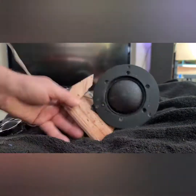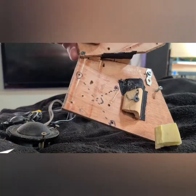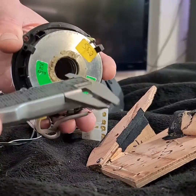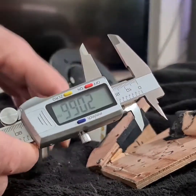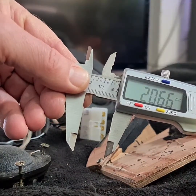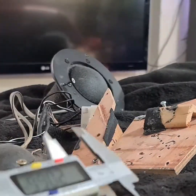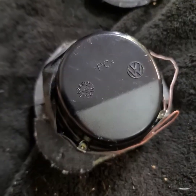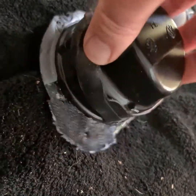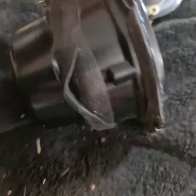So I'm taking off the tweeters there and the 52. There's the plug, and I'm devising a small opening that matches the end of that. Let's call it an air gap in the magnet, which is about 20 mil, into same alignment on that backing board. Tried my hardest there to be scientific with the angle, and drilled out a 21 mil hole, allowing for some material to go on the inside of the hole.